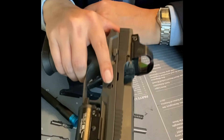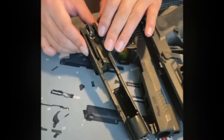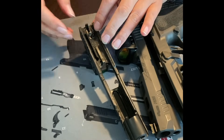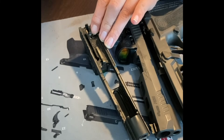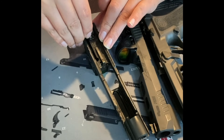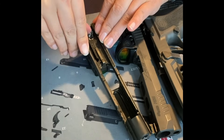There is just one key difference between my friend's P320 and my P320 when you run them through some preventative maintenance checks and tests. The striker is supposed to be able to move forward when the striker safety lock is disengaged. To disengage this, a little safety finger on the frame pushes up, pushing the lock down, which then lets the striker move forward. On my P320, when we let go of the striker, it rebounds, and that gives the striker safety lock enough room to hop back down into place to prevent it from pushing forward all the way.